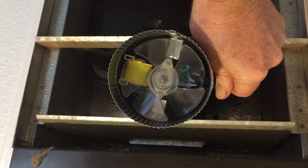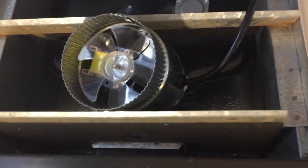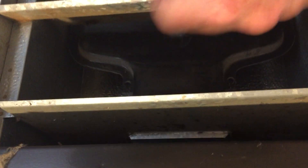It works really well. What I have thought about doing is putting a fan right here at the top, which would really blow the heat out. I haven't tried it — this fan probably wouldn't survive there; it would likely burn up. I do have some high-temperature wire on the switch, but the fan itself doesn't have high-temperature wire and probably isn't rated for high temperatures. If you found a high-temperature fan, this would be the place to mount it, because that's where most of the heat is.